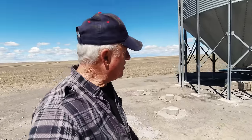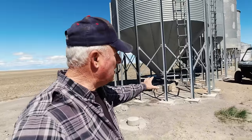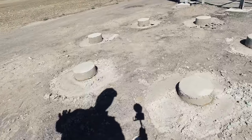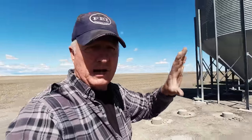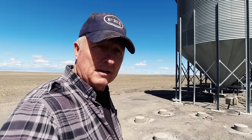We have the hopper over here now, transported to our bin site. We did pillars — drilled holes in the ground, put cement and rebar, drilled anchor bolts and mounted them right to the ground. We've got these pillars here already done, as you can see. We're going to go ahead and repeat what we just did — have the boom truck with the back end pointing here, drive the trailer with the hopper bin alongside, pick it up, and set it on. We can fill it with some good stuff — maybe coffee beans.